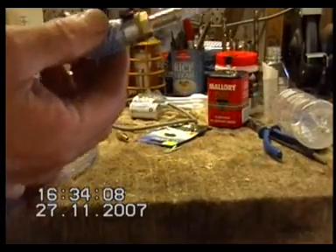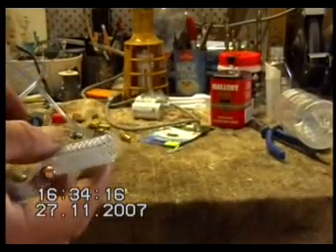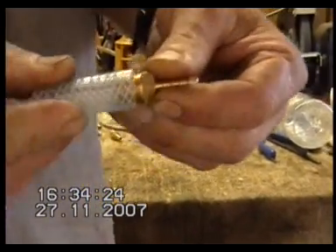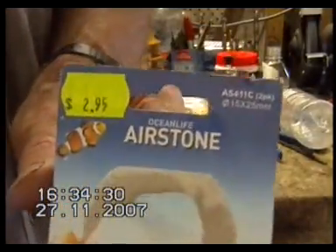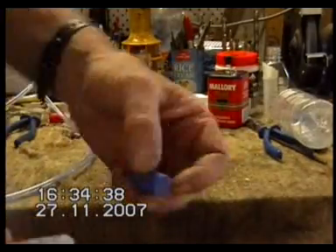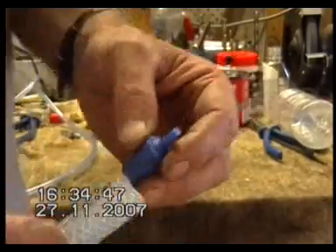This is one I've made up. We've got a piece of small hose — this is a 15mm diameter inside hose. You get two of these fittings, gas fittings from plumbing shops — they're a very neat fit on the end of the hose. You get some fish tank air stones; these are the type I'm using now. On the packet it says 15mm diameter, so that makes them almost too tight a fit in the hose. I've soaked that in some hot water and you can jam them right up inside there, which makes a really super fit around the outside.